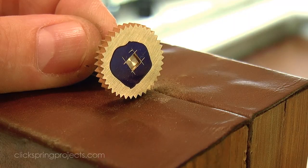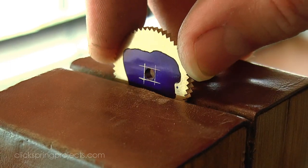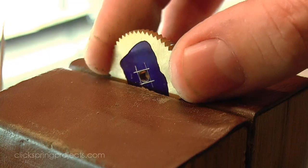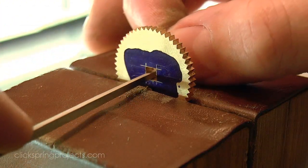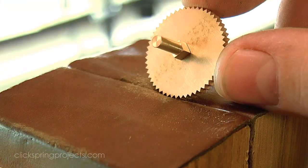This assembly sits directly beneath the main solar drive wheel B1. The clearance between the top of the assembly and the underside of B1 is less than a millimetre, so by design, there's not enough room for a retaining pin to be used on its upper surface. And rather than provide a shoulder for the two wheels to face onto, the pivot has been deliberately turned smaller than the square mounting boss, presumably to keep the pivot friction to a minimum.